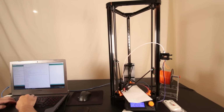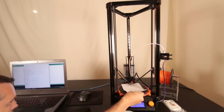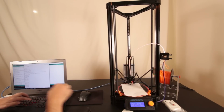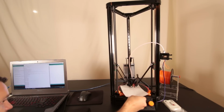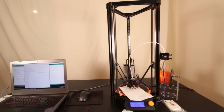Let's go to G0 Y80, or I'm sorry, X0 Y80. And a little tight there as well. Still is tight. Interesting thing is, as I move it, G0 Y0, enter, it loosens, and then it catches again right there in the middle. So it's kind of doing a micro lift in between those points.